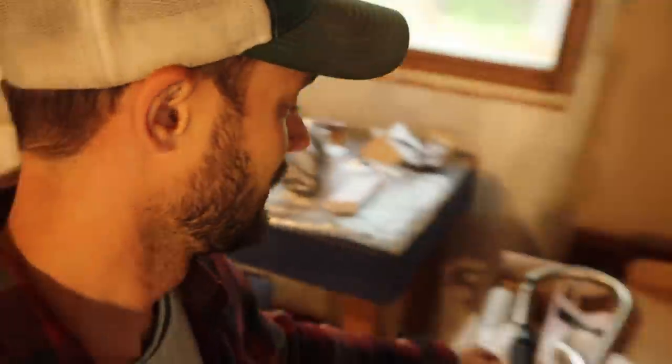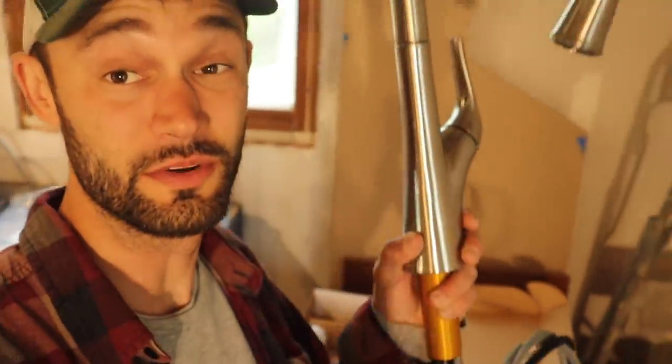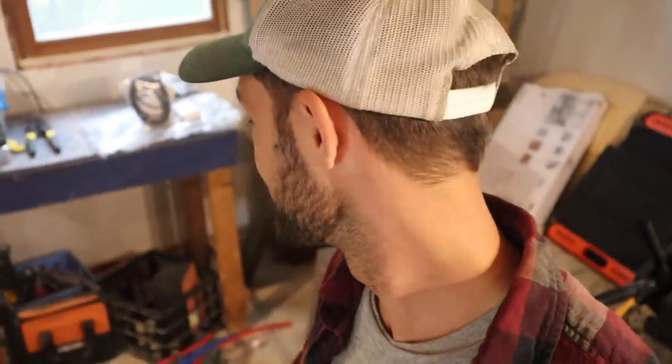While my dad is putting the electrical lines in, I'm gonna grab all of the sink, faucet, drain stuff, and I'm gonna install all of this now. And I think at this point, I've learned, install or dry fit these as much as possible, because once I get it in there, I've got like 2 inches in the back to try to get the nut on that guy, and it's a mess. So I'm gonna try to pre-install a lot of this so that when I actually get the sink in, it's pretty much done.